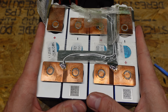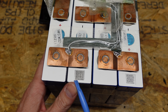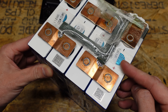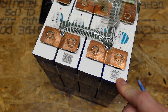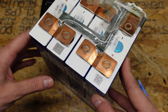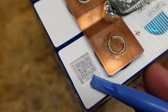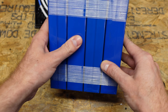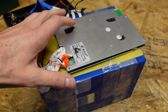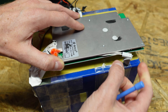So why didn't these cells test at 100 amp hours? I can tell these are Eve batteries because the QR code starts with 02Y, which is the manufacturer identification used by Eve. They also have the classic Eve style of two circular terminals with a circular vent in the center with a blue vent cover. These cells are actually 105 amp hours — proven by the last cell's QR code, which includes nominal voltage and capacity, reading 3.2 volts at 105 amp hours. The cells appear nice and flat, not bloated. However, there is no external temperature sensor on the BMS anywhere, which would normally indicate low temperature charging protection. I found one temp sensor wedged in under the heat sink, but I'm not sure what it's for.